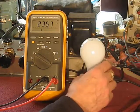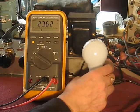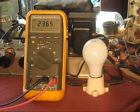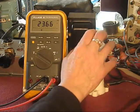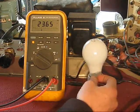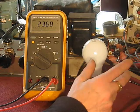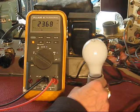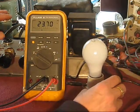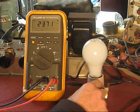So if you're really curious about it, I'm using a 60 watt just as a blowout preventer. If a serious trouble develops, you'll see it, especially when you get line voltage up to around working voltage. But just to have something there, something is good. But you could use a Christmas bulb, Christmas light, something 7 watts, 5 watts, and you begin to see the current flowing, and it does give you a sort of relative indication of what the current into the chassis is. And if it starts changing wildly without any tubes in it, except maybe the rectifier, you'll know that something isn't right, and it's usually some stinking capacitor.